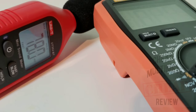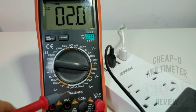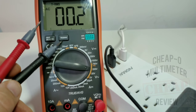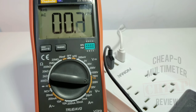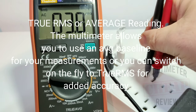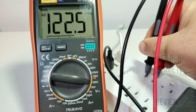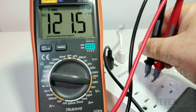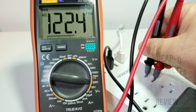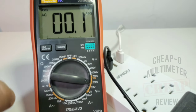Maximum output in decibel mode: a very nice 78 dBA — loud and latched. Now sitting in AC mode. They don't call this a true RMS meter — they call it a true average meter. The true average button is what you press to get a true RMS reading. Starting with a basic AC test without true RMS: coming up at about 122 volts. Without removing the test leads, hitting the True RMS button: 121.5 volts. Disabling True RMS we're back up to 122.4 — about a 1-volt difference. Kind of a nifty little feature.